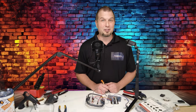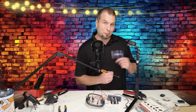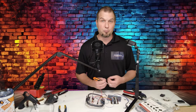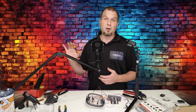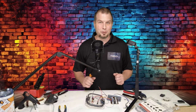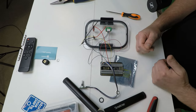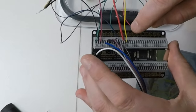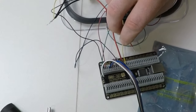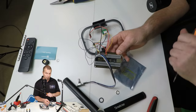Now with that being said, because they're wired in series, if either of these wires come apart, just like with your Christmas lights when you pull the bulb out and the whole thing went dead, well that's essentially what would happen here. If one of these come free or break loose, then all of the switches prior to that break will be dead. They will not work. So there are pros and cons to doing this method. We now need to wire up our second switch. Again, we'll move to the second pair of open terminals which is going to be our B8 and ground. Now because we've already daisy chained all of our grounds together, we only need to insert the positive into the B8 slot. And that's pretty much everything wired up to the board.